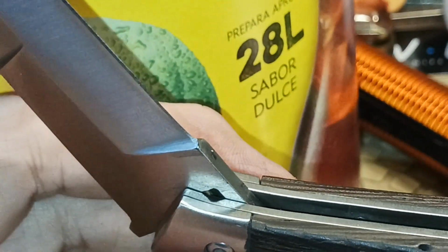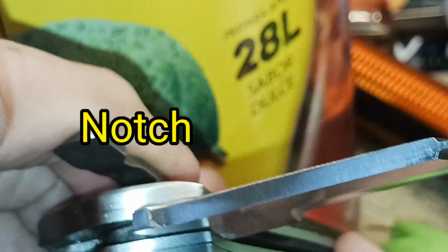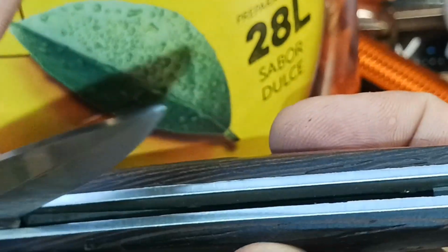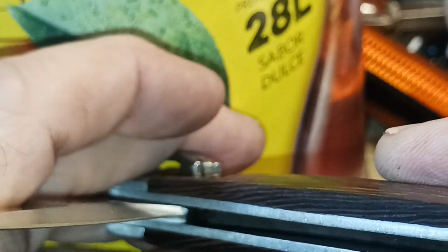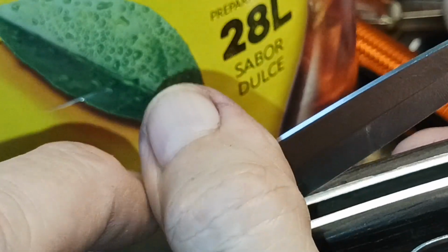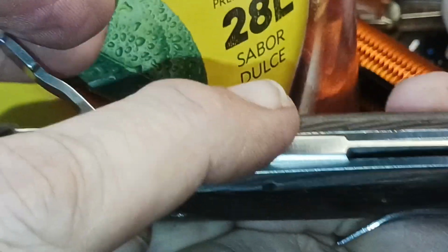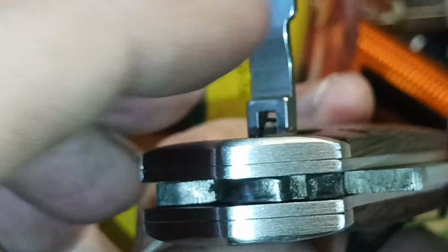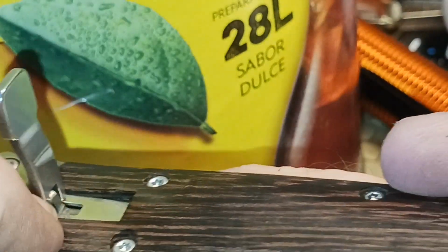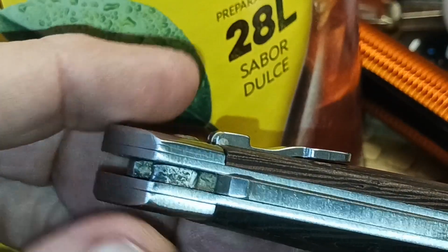Now right there you'd think, oh, it's got a half stop. No, it's running into that other pivot as this is camming past it. And then you don't meet any spring resistance until the tang right here touches that upright piece of metal. And then pushing it down, you're better going over here on the thick part, but you still usually have to get a little assistance. And once you got it down, it locks, because of the spring tension of this piece of metal, it locks it up in place, and now it's secure.